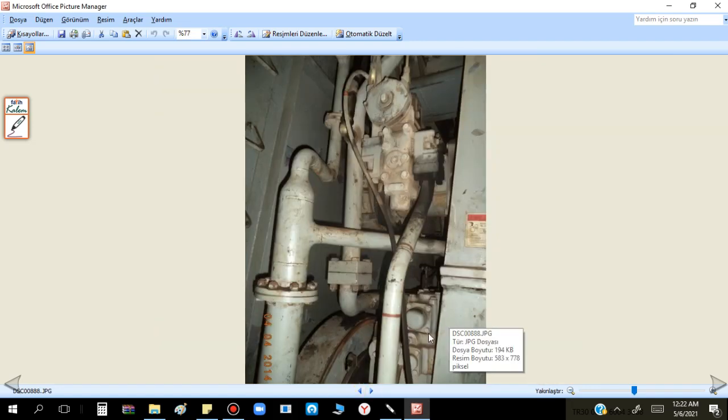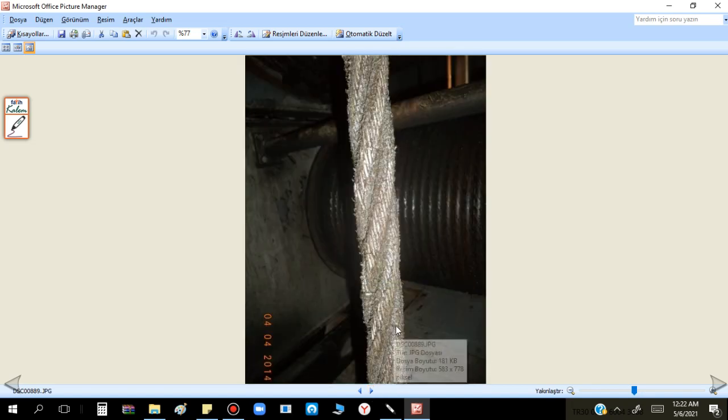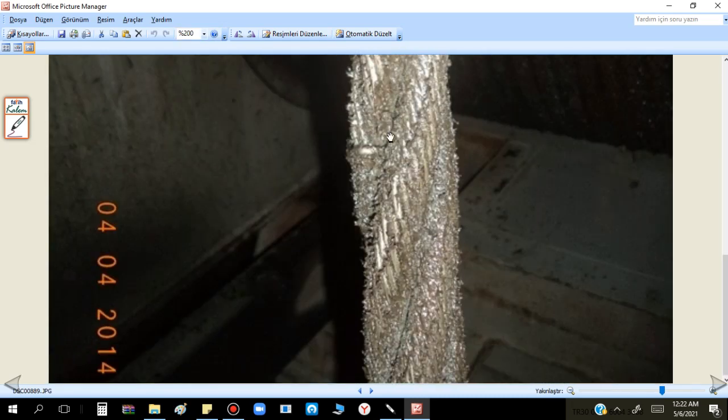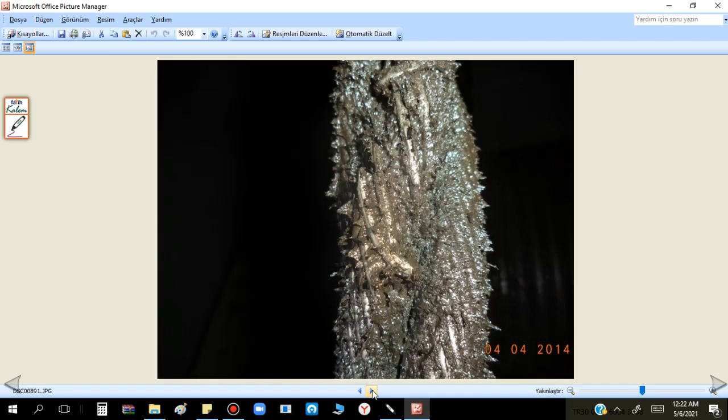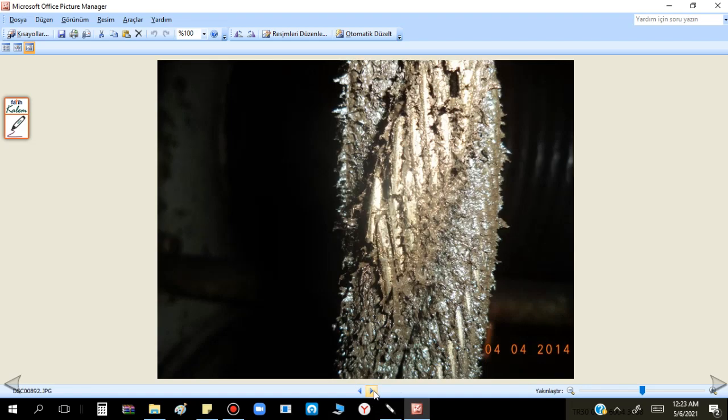This is the hydraulic mechanism. I will show several photos. This is the wire - you see here some parted wires, you see it changes direction. When you go to the cranes you just make a visual inspection and you can see some small broken wires. Here there is a gap - too much broken here, too much. It means it is easy, easy coming to the time to change the wire.